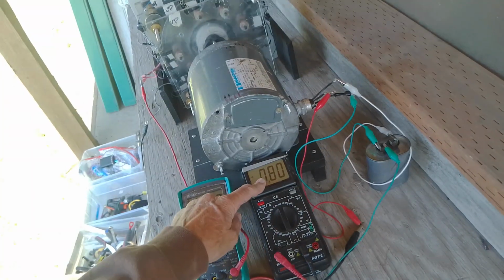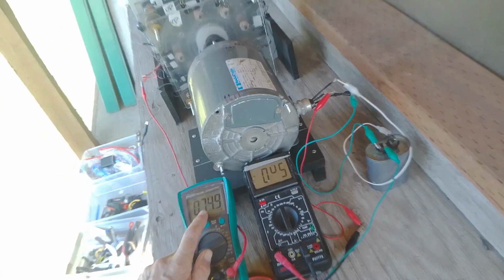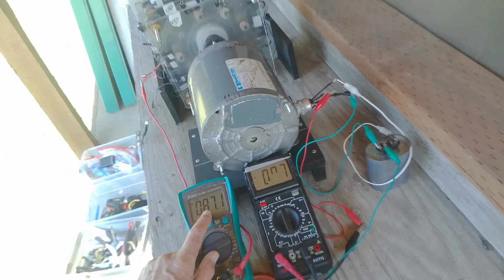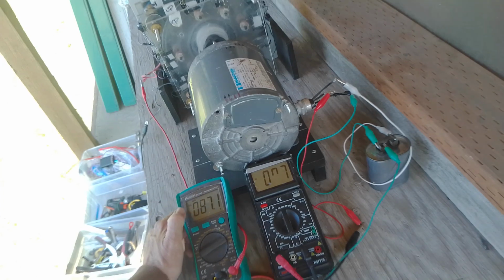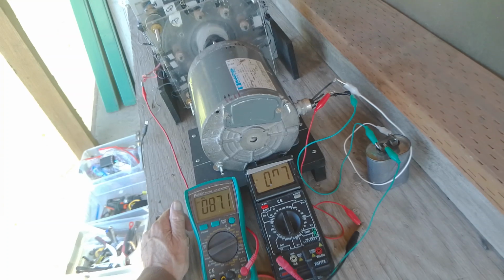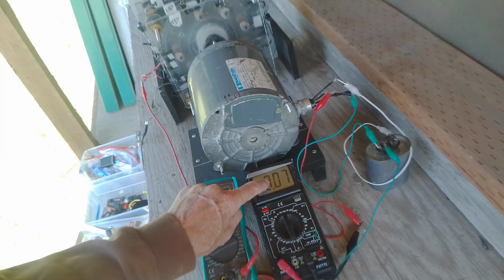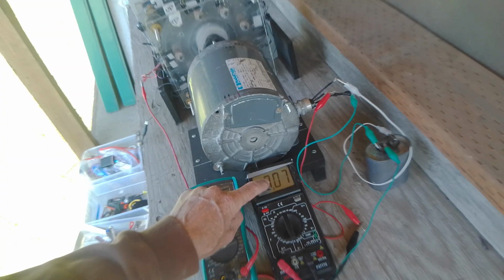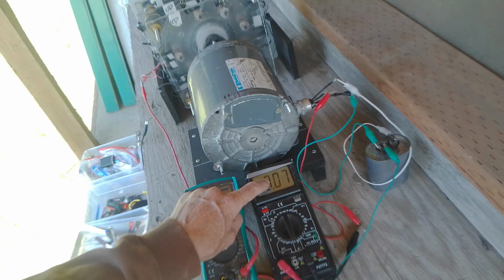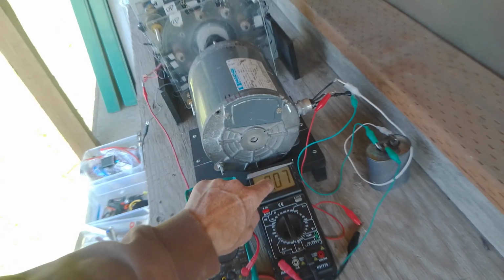There's the draw, 800 milliamps startup. Here's the voltage, a little more than yesterday. There's 14 coils and I had about 7.2 volts per coil in AC, so this is DC into a cap. And look at the draw now. 0.07, that's really pretty good. Pre-spinning, there's no coils loaded. Notice I didn't even need a start cap. This is 4 uF.